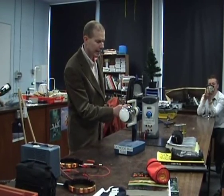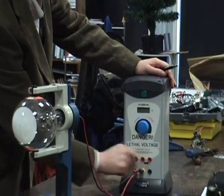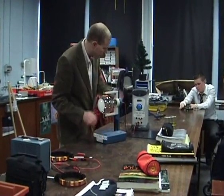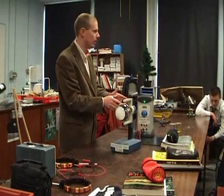The first thing we want to do is heat up a small piece of metal here in order to excite the electrons so they pop off. The filament is at about six volts, so I hook those six volts into the back here. As soon as I turn it on — if we can turn the lights off — you can see the orange glow inside there? There's a little filament inside that's lighting up. So there's six volts being applied to that.